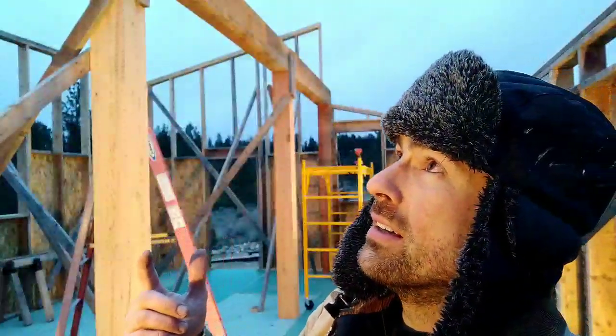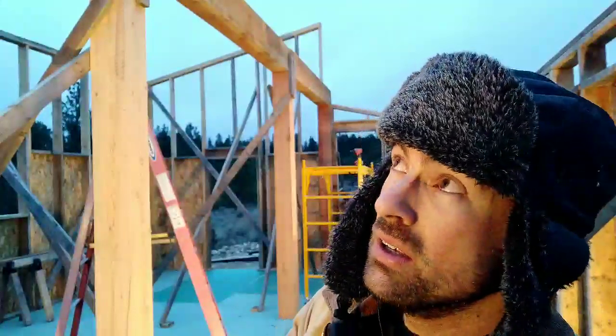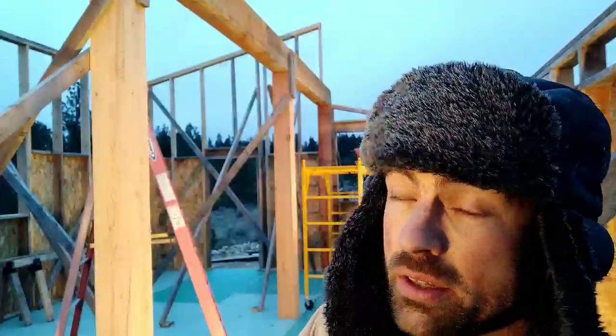And I think I'm gonna put something that people use for, what do you call it, if you're gonna wedge in something, shimming. Excuse me, I couldn't remember the name of it. So shims, you can use wood shims, but you can also use shingles. I have a lot of spare shingles lying around because I use them for that sort of stuff. Shingles are nice and easy to use, but I do want to consider that on the back side of these timbers, it's going to be showing that room in there. So I don't want to have a shingle sticking out of there, visible. So I'm thinking I might just use some angled wooden shims that look like a wedge. I think I have some lying around, so I'm going to go try to find some. Yeah, I'll do that. I'll be right back.